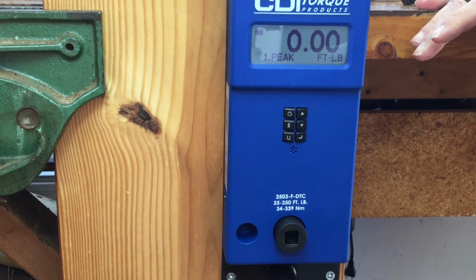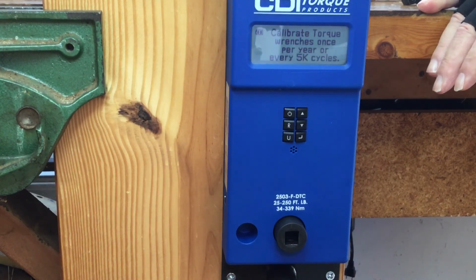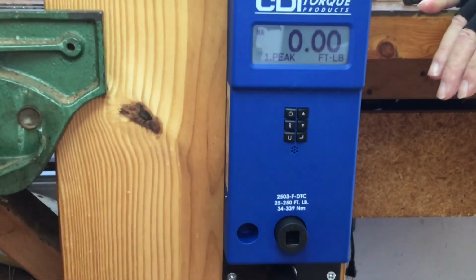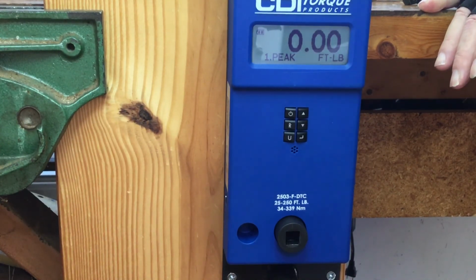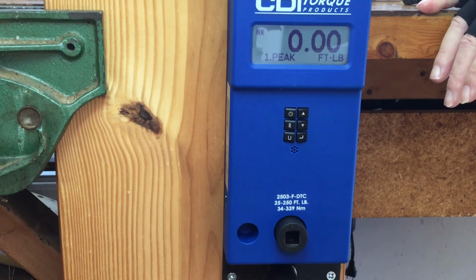The Craftsman came in at 134.46. I thought they were both high, especially the Pittsburgh. The Ulster, the split beam, came in at 129.1. And incredibly, the Powerbuilt averaged 130.7. So I don't know if the Powerbuilt's the greatest thing that no one knows about or very few people do. But I was impressed. If you're going to be doing tires a lot and everything, go with the split beam. It's quicker. You don't have to reset the pin. But the Powerbuilt seems pretty accurate.